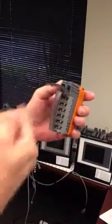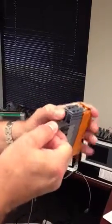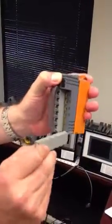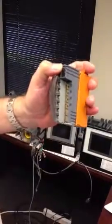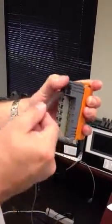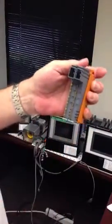And the first thing you do is remove the connector. You just lift this up, you pull it straight out, and there's a little button at the top. You push, and the connector comes down, and you lift it off. It hooks on with this little clip here onto there, so you know how it goes when you put it back together. So you take that off and put it aside. And you have to take this one off as well. So pull that out, push on the tab, down it comes, and take it off.